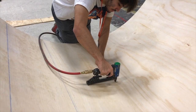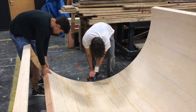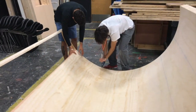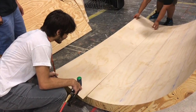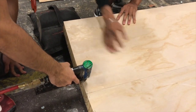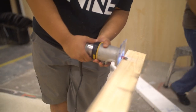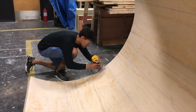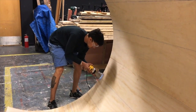Back to what we were doing earlier — he's laying down some staples in the center, pressing down hard making sure those staples go in nice and firm. We're also making sure that we're pressing the wood skin down to the frame so it adheres to the frame in the shape it's in. You want to make sure your two sides line up and your bottom edges line up because you want this thing to be square when you're all finished. Anything that's overhanging, just run the laminate router over it and take off that excess with a flush trim bit — do it on the sides and the bottom as well. If you have a lot overhanging on one side you probably didn't square it up too well, so watch out for that.